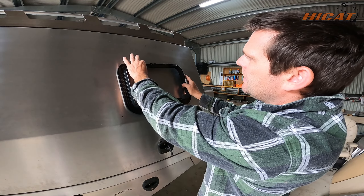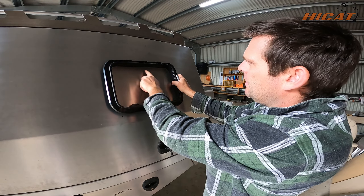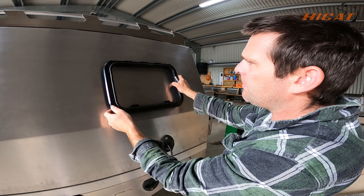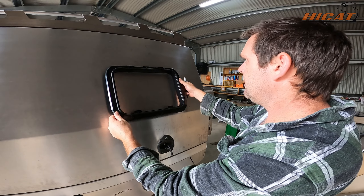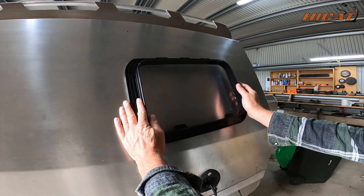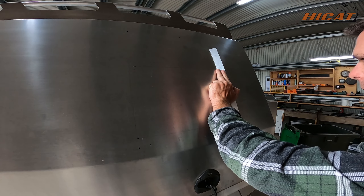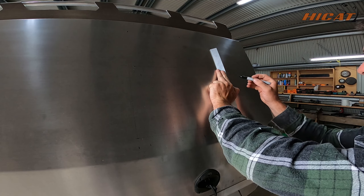So we've measured our width, we've measured our top plate — we can't go any higher than that. Have a look at the flange; we'll sit it on the back. You see the protrusions there — have a look where they sit up here. It leaves a little bit of framework, so I'll go all the way up — gives me something to screw to up there. It doesn't look as good sitting on the fold, so we'll go ahead and mark that all out. Mark the outside, hold the plate over it, and I'll mark it in black with a black Sharpie using a bit of aluminium angle.